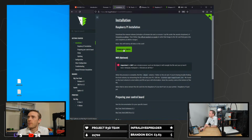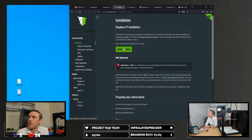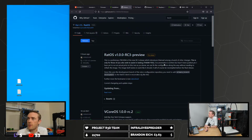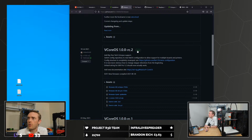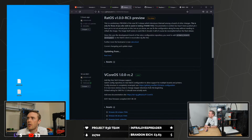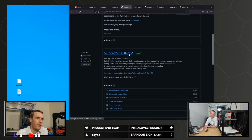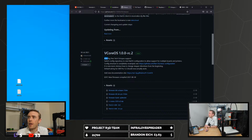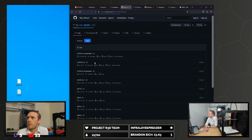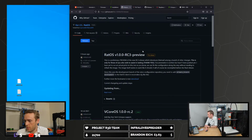So let's get started. To begin with, we need to download a bunch of stuff from not only GitHub, but other places too. So V-CoreOS obviously is the firmware that we're going to be installing. I'm not going to be doing the pre-release, so in the future what you're looking for is the latest version or a release tag. Pre-release ones you probably want to avoid unless you're doing some testing. This is strictly not a released candidate. This is release candidate 2, meaning it could be released as this one soon, but it has the Octopus support in, so I'm going to be going for this version. You may want to just find a full release if you're just doing a stable build on a different controller.